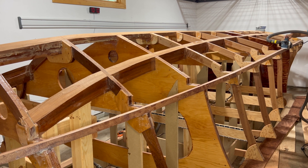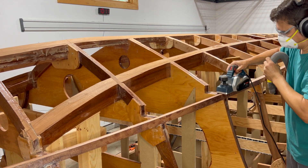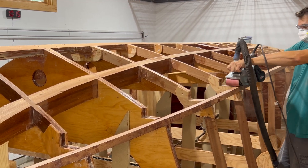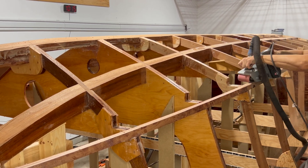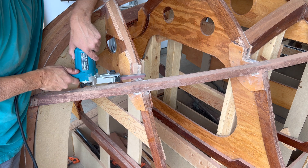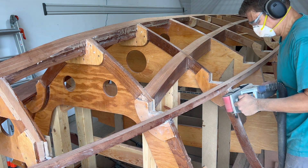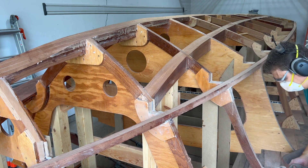The chines fit flat on each of the frames, so we must plane the bottom of the chine top rail to be parallel to each of the frames. First I use the power planer, then do the majority of the leveling with the belt sander. I shape the frames to fit the chines with the mini belt sander, and finally I shape each of the frames to ensure the chine top rail has approximately a one-quarter inch overhang over the side of the rails.